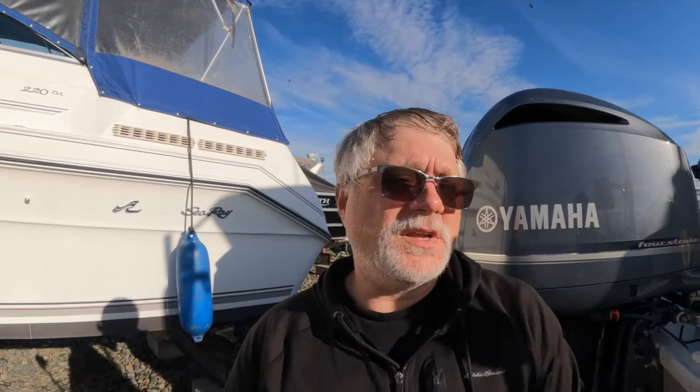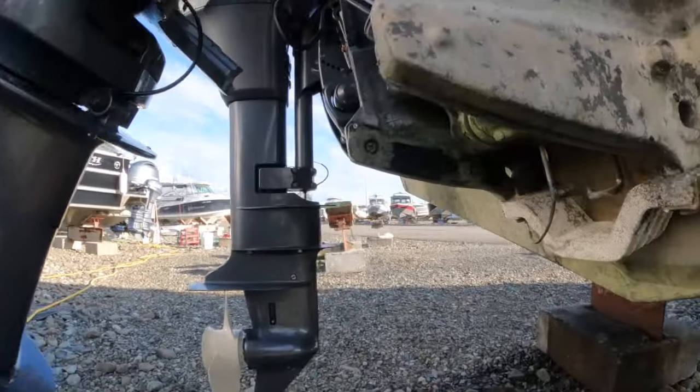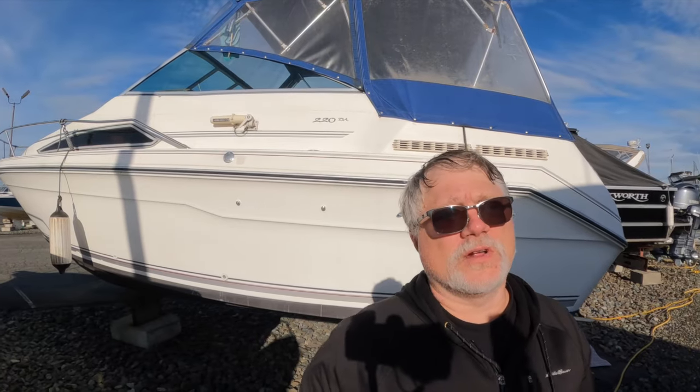Aluminum doesn't have those problems. Aluminum works as good as zinc does, and if you expose it to air or fresh water, it works in both fresh water and salt water and doesn't have the problem where it'll get that protective coating and stop working. So for these reasons, I went and changed out my trim tab anodes, the transom anode, and the trim anodes — I changed all of them out to be aluminum. I've got much better wear out of them. They actually dissolve like they're supposed to, so I no longer have the pitting and the anodes coming off looking like the surface of the moon with big craters where parts of the anode work and other parts don't.